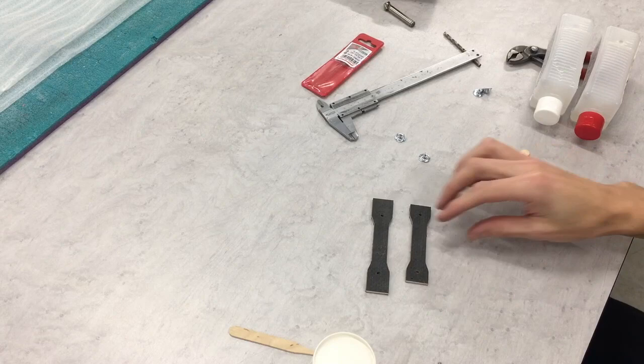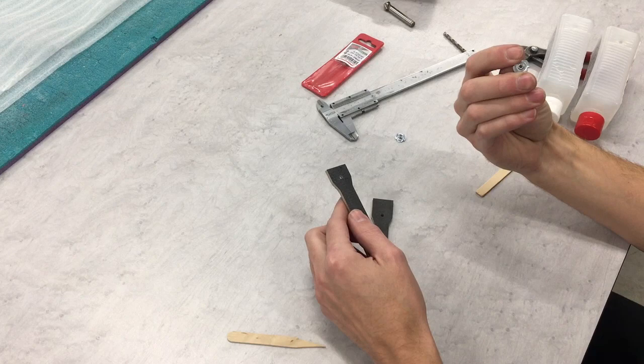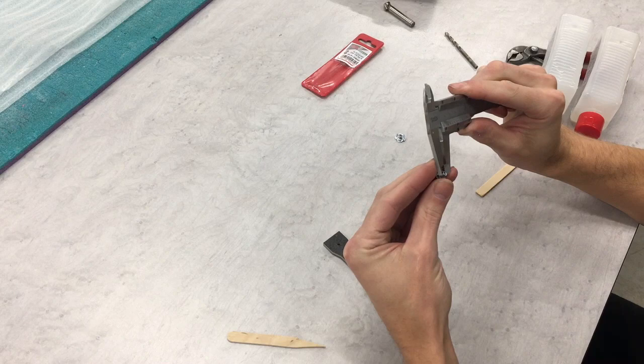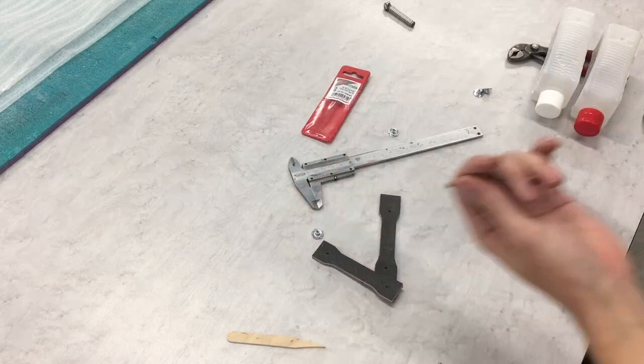I am going to start with the swing back mount pieces. And first, I want to mount these standard M3 blind nuts to these holes. And it seems that this will not fit. So maybe there is some mistake by designer already. This seems to be 4.2 millimeter. So I'm going to use 4.2 millimeter drill bit and open those holes a little bit.